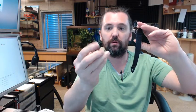You will get, of course, 1 tiny screw, and those machine screws go through the inside handle and communicate to the exterior like that. You'll get 1 short little stub screw for here. Stubby screw. Looks like a number 8 by 1/2 inch. Then you will get 2 sheet metal screws for the frame, and that's for the strike, obviously. Those would be plenty long enough to get through the shims. So there is a link below this video to the instructions.